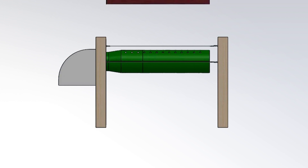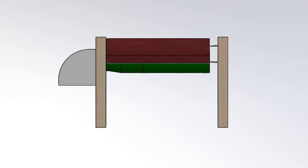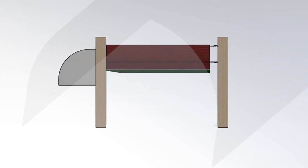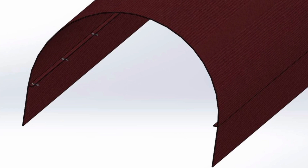If you have the optional airflow deflector sheet, drape it over top of the flap duct and horizontal support cables. Snap hooks sewn on the inside of the airflow deflector sheet secure it to the cables at 3 and 9 o'clock.